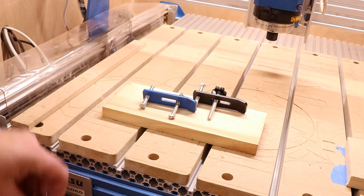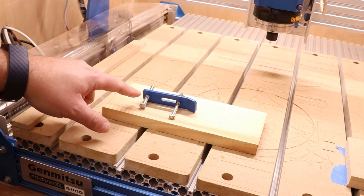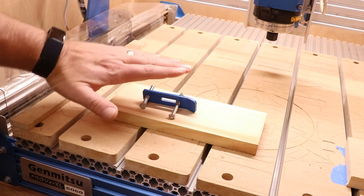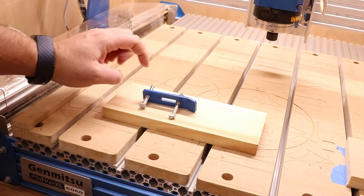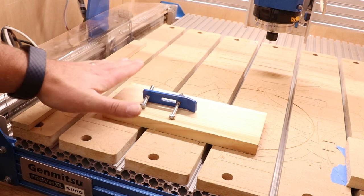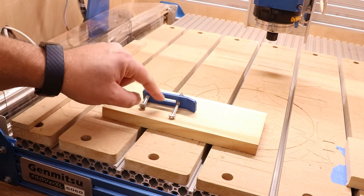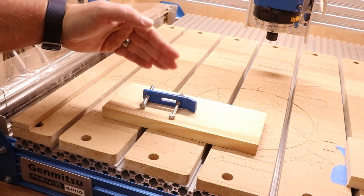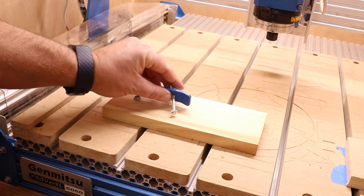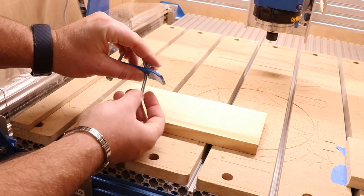Often you have a slot in the middle and a threaded hole on the end, and people are never quite sure which way it works. The hole at the back is about leveling up the clamp — put the bolt in there with the flat head on the bottom for more surface grip, and then the bolt with the wing nut or knob goes through the slotted hole, allowing you to apply pressure down as needed. One possible downside to these clamps is they can be limited in height — let me quickly show you this now.